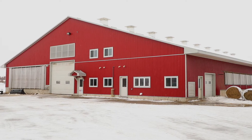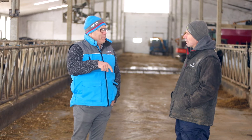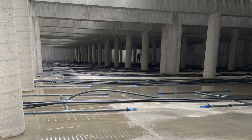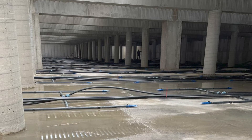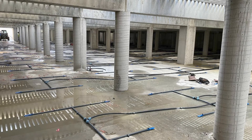In 2015, we built a new freestyle barn. Prior to that, we milked in a tie stall. When we built the new barn, that's when we installed the EasyFix air system. It was simple to install at that time. We could just lay the hoses on top of the cement floor at the bottom of the manure pit, and it worked out well to put that in during the time of construction.